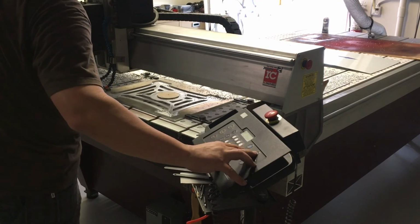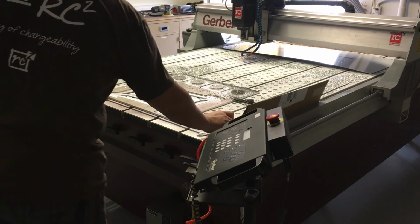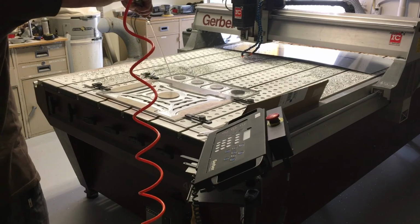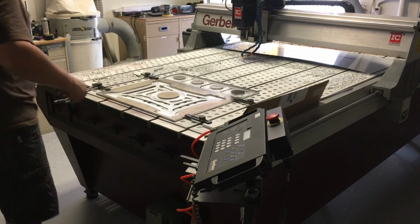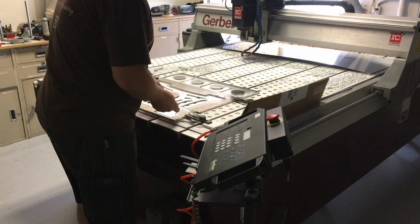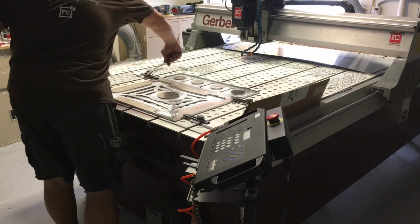So now you realize how much time is actually involved in making the plate. 3 hours and 45 minutes of cut time. Chris still had to design it before we cut it. Then he has to clean it all off. When you CNC it out, you can't CNC through the entire 3/8 of the plate or else that centerpiece would start flopping around. So when you clamp the plate down and CNC around the outside perimeter of the plate, you leave just a little bit of webbing on there.